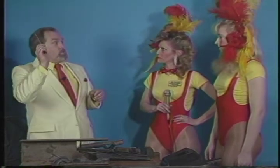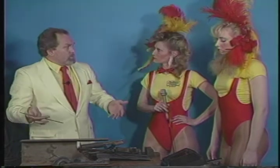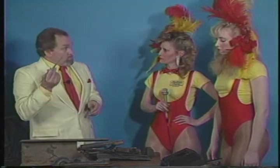So I ended up using it, though it's not practical in all circumstances. It's very difficult to do overhead welding with it, if not impossible, and even vertical welding is very difficult. But if you're just going to do downhand welding like what we're demonstrating here, the simplest form, you can do real nice work with this stuff.